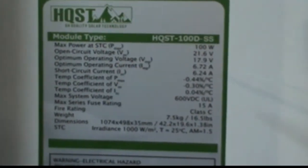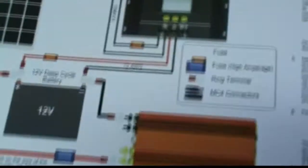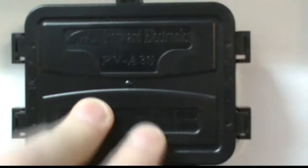Here's a quick peek at the solar panel — 100 watt, like I said, and it came with a good little diagram showing what we're going to be doing. I took it outside and confirmed that the end with the little red gasket is the positive terminal, and this is the negative. The panels come with diodes pre-installed, which is great, and they have a little watertight cover to keep it dry. Looks like everything's in good shape, so next we'll put the brackets on.